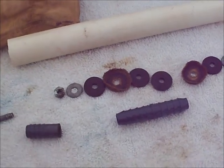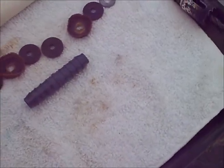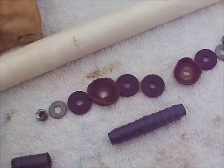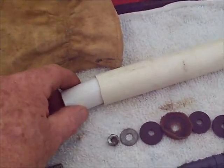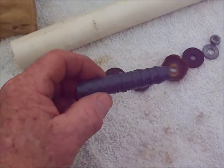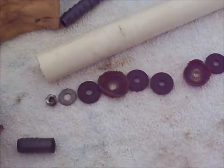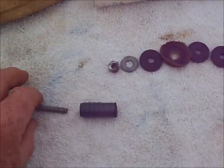If you need to go down 10 or 20 feet, you can use this to connect that. The reason you need to do that is because you can't connect the half-inch pipe with a regular half-inch pipe coupling, because it won't go through the one-inch pipe. But if you make all your couplings with this, it'll go through your pipe and slide up and down just fine.